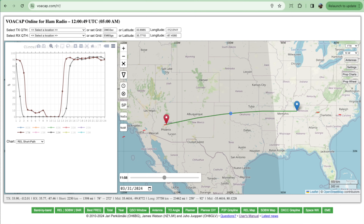There are four things we need to keep in mind for a long-range targeted contact: who that person is, where they're located, what their skills are, and what gear they have. In my case I'm in Arizona, the gentleman is in Tennessee — a 1,500-mile contact. That restricts our techniques to HF. He's a General Class operator in the US, so he has HF privileges. In terms of gear, he only has a Xiegu G90, which limits us to 20 watts. That means we're really stuck to digital modes.